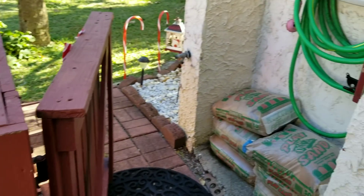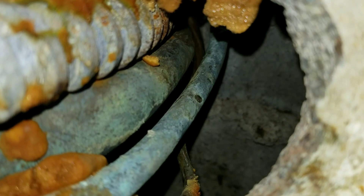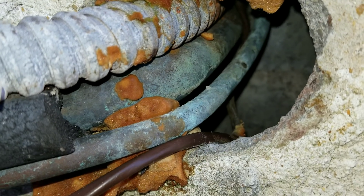So basically what I found — my camera probably won't show it well, but I'll try — you can see the liquid line and the suction line are very close together, and that thermostat wire was wedged between these two lines. With no armaflex on this suction line and this being a heat pump, over time from either vibration or heat it had almost melted the thermostat wire. You can almost see some green right there — I'm thinking that's exposed control wire inside that sleeve, all wrinkled up.